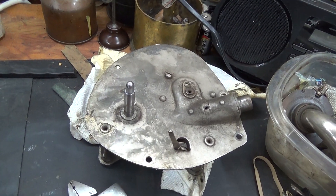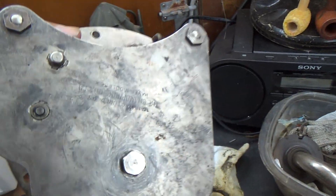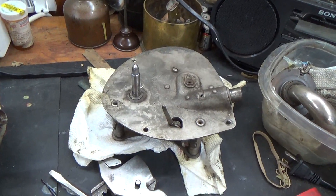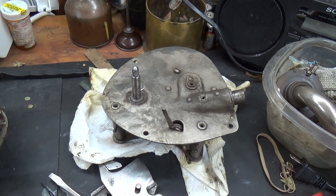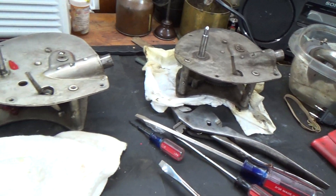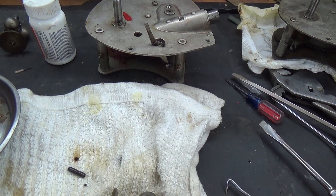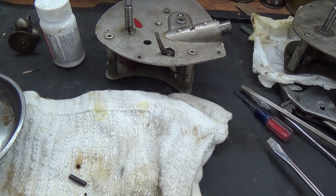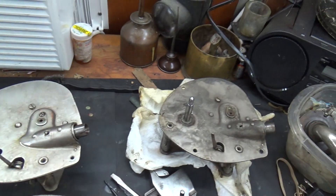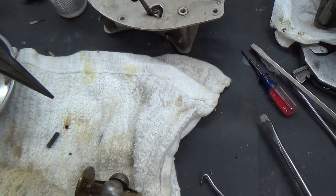So I resorted to a spare motor — actually out of a late 101, exactly the same motor except it won't say 270D on the bottom, just says 'Gramophone Company.' That's the latest style of the 101's motor after they stopped using the number 59. I took the bearings out of that and had exactly the same problem — could not get those little bearings out no matter what. I let it sit an entire week in solvent, occasionally agitating, trying to bang them around. Nothing was working.